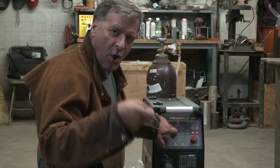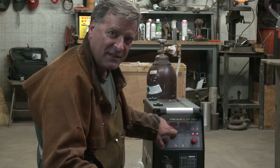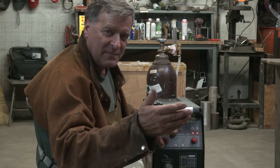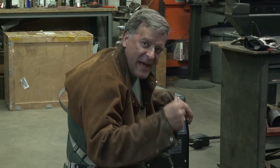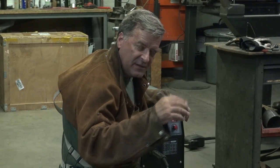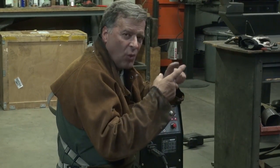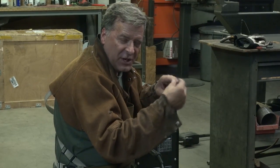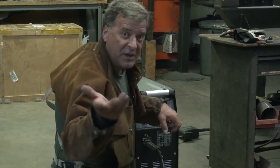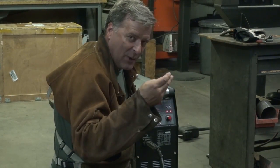You've got to pull the trigger again to get it to stop. When you pull the trigger the second time and hold it, it will drop down from, let's say, 100 amps to whatever that end amps is set at, cooling itself off in however long you take. Then you let go of the trigger and it stops. And then you have the burn back time — that's when you let go of the trigger and the arc stops. The machine gives just a tiny bit more voltage or amps to burn that wire back up towards the gun, so you don't have a big stick-out hanging there. That's burn back, and the burn back voltage is how much you tell it — milliamps, amps, whatever — to burn that wire back however far you want.